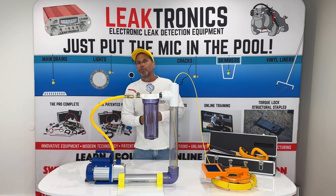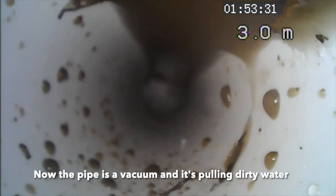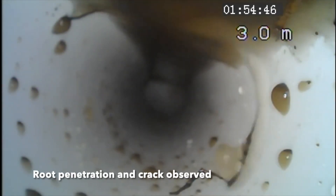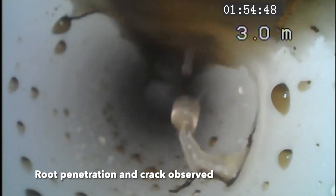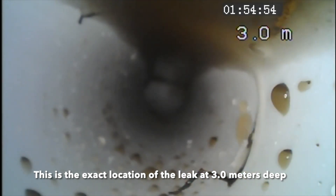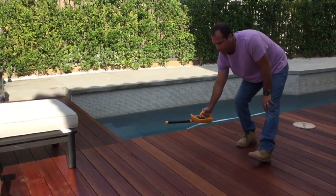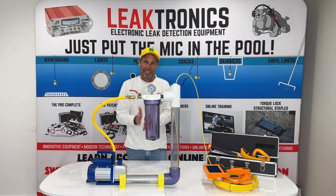We could do it two ways. We could do it with the pipe dry. It has saturation outside the pipe — we turn on the vacuum pump, and that allows water to suck into the pipe. Roots and debris will literally suck into the pipe. When we see where it sucks into the pipe with our camera, we leave our camera head there, fire up our scanner, scan the deck, get over the camera head, and we know exactly where our leak is.